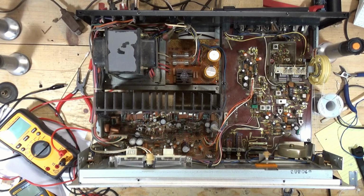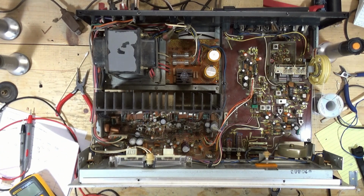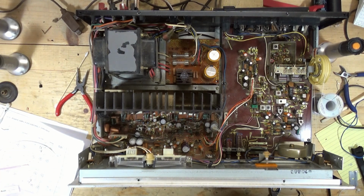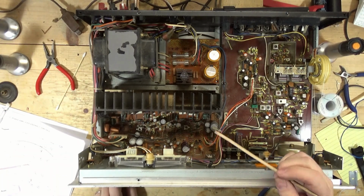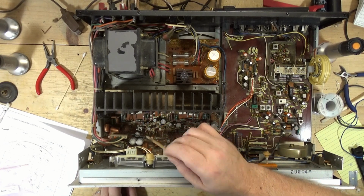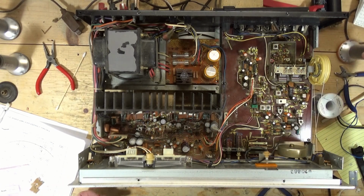This one was an absolute troubleshooting nightmare. I had to go out to Audio Karma because it was not making sense to me at all. I don't really understand some of the circuitry in the service manuals. It still doesn't stick. It's not intuitive to me to look at a circuit and know exactly what it's doing. So I'm going to boil down several hours, maybe 2 hours of testing, to one transistor, and that transistor is right here. It is Q23. It's part of the muting circuit or the protection circuit. It's covered on page 11 of the service manual.